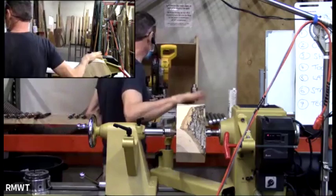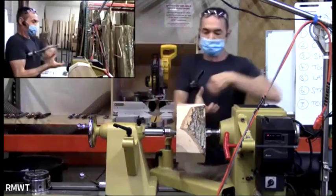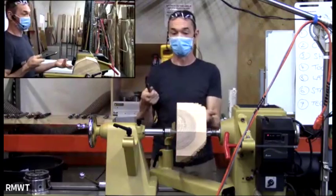So to prep it, what I'm simply going to do is take my regular, what I call my 40-40 grind, and I'm just going to prep it real quick. Now, it's between centers. Is this ideal? No. I could make a faceplate and put some bolts through it and sharpen the bolts. There's a whole bunch of ways of supporting this, but a nice big drive center, no crazy speed, and nothing's going to go badly wrong. And I'm also not going to stand in front of it. So I'm going to start off slow. So give me a minute on this lathe.